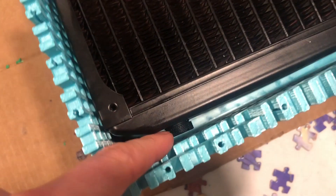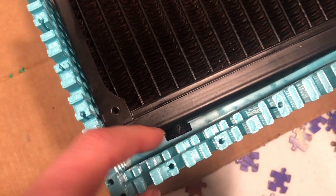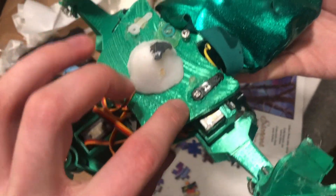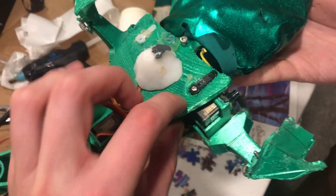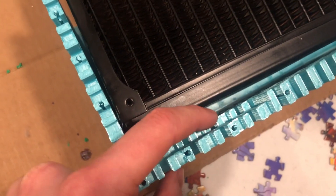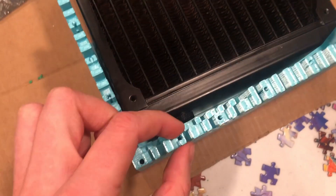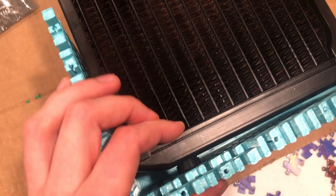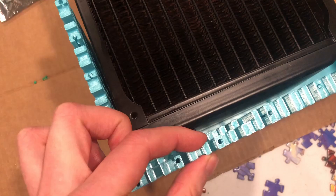I have a clearance issue where these caps are bigger than I expected, but my brother on his robot ended up heating up the plastic and smashing a servo horn into the 3D print after it was warmed up. So I'm going to do the same thing — heat up this wall, and since it's only 10% infill, I should be able to collapse it and smush the radiator and knob into the plastic.